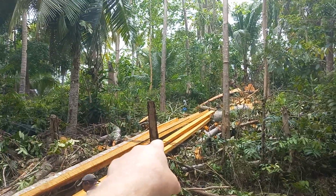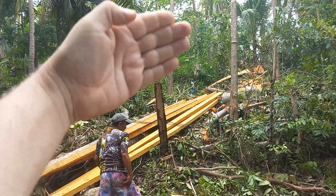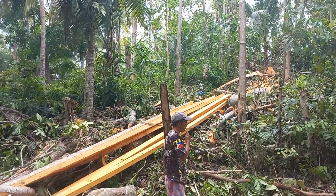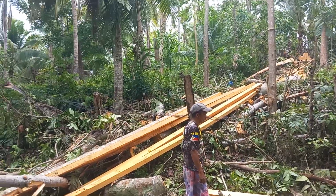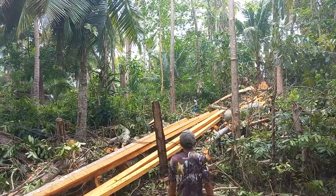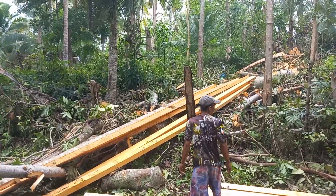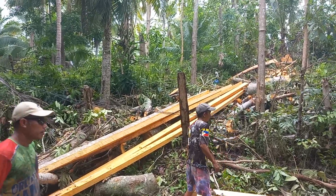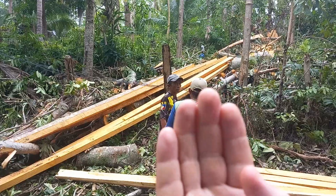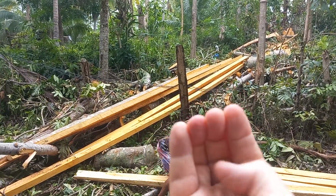And this one here, I've instructed them to cut it what you call through and through. So you just slice through the log from one side to another. And they're going to be 3-inch deep. And then I'm going to use my router to flatten them, and then cut them so that they stand upright like that to form the headboard of a bed.